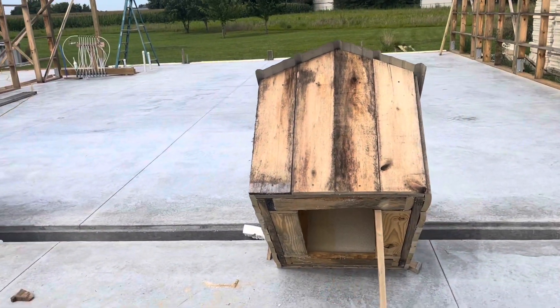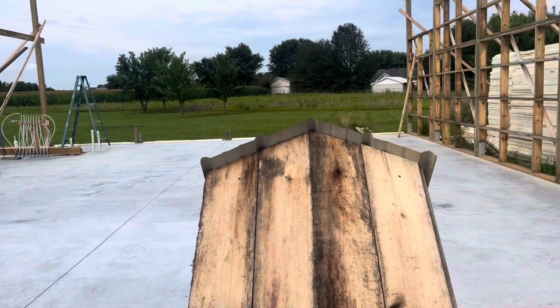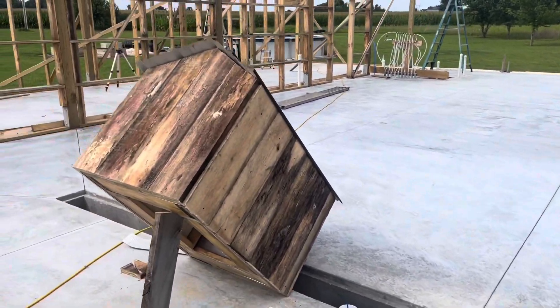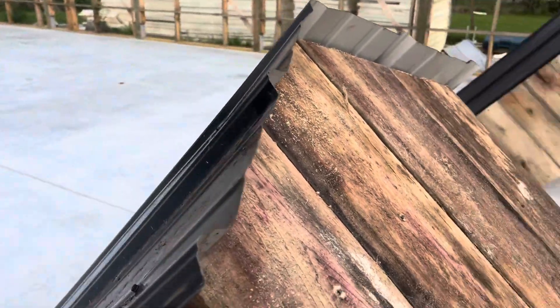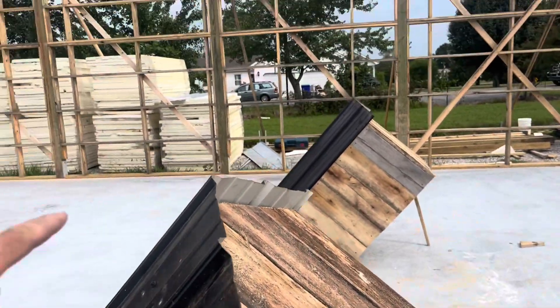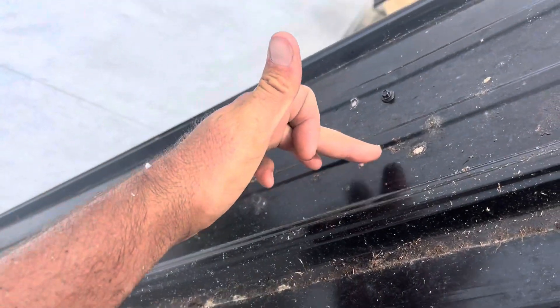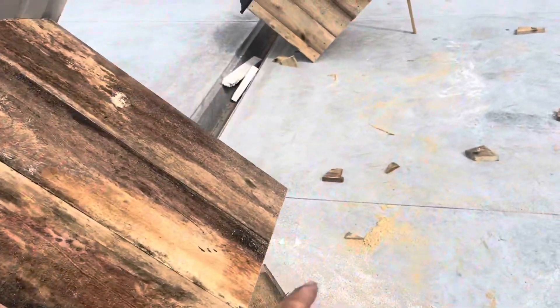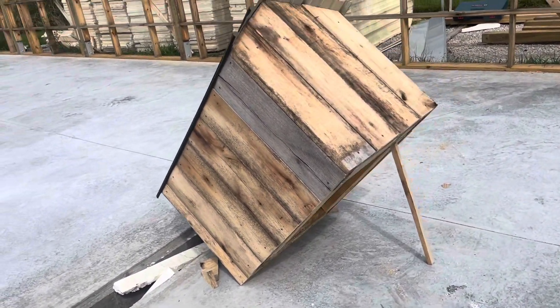I've got the buildings finished — the little mini shops. Mini shop one and mini shop two, that's what I've got the thermometers labeled as. I got them propped up, put a screw up there at the same height on both. I tried to eliminate all the variables I could. The only variable I can think of is that the one with the radiant barrier has a splice in the roof on the two-inch foam — I didn't feel like cutting up another whole piece. That's the only variable between the two aside from the radiant barrier.